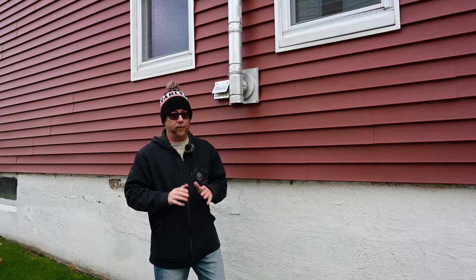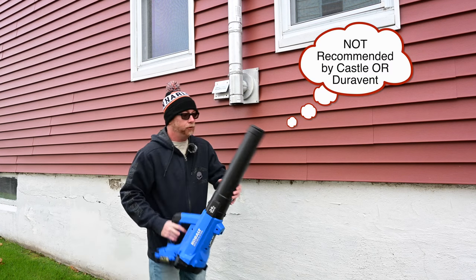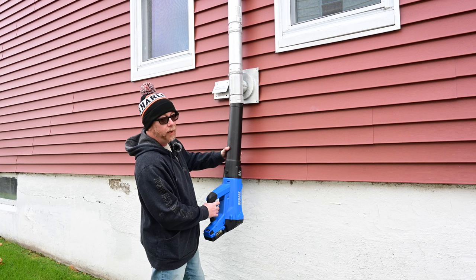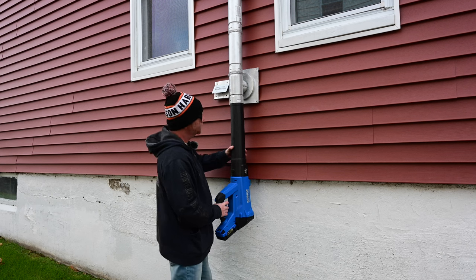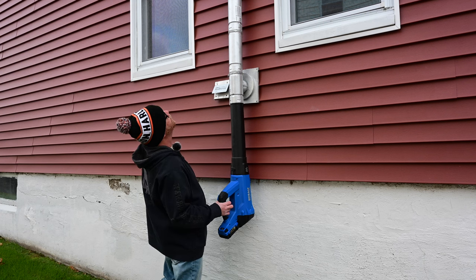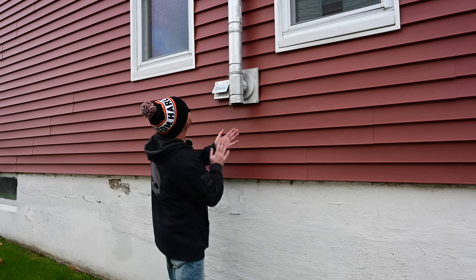The second step, like I said, is not recommended by Duravent or Castle. I use a leaf blower — just a regular electric leaf blower. The only thing that sucks is it's gonna rain down soot, but it will clean. Make sure that door on the inside is closed because this will blow right into the house. You can see the stuff coming down. You can hit in the face with it. You don't need to do it that long, and once you got that tackled, that's pretty much it.